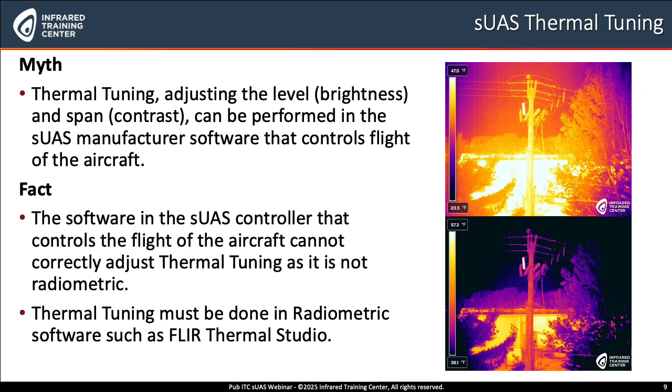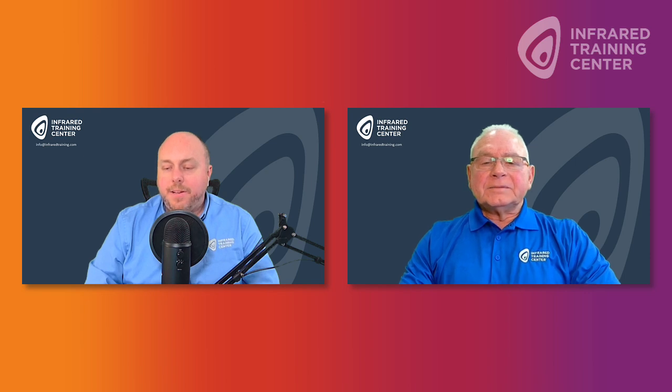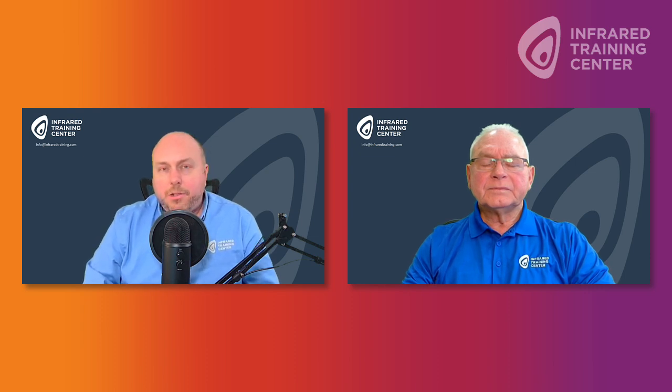And that issue is the insulator is hot, and it should not be, and it's very hard to see in the image that the camera took. So how about this one, Bill? When it comes to measurement accuracy, we talk about how accuracy can fluctuate by plus or minus 2% or 2 degrees Celsius, depending on the measured value. Is that true or false when it comes to operations with aerial infrared thermography?